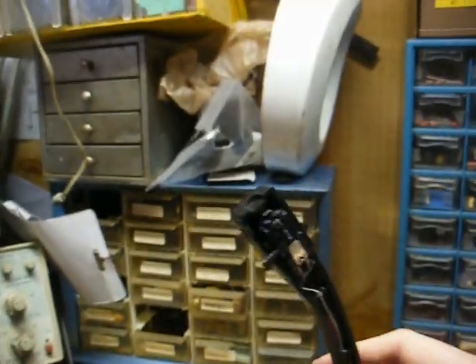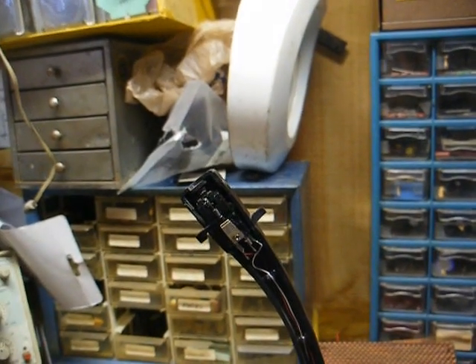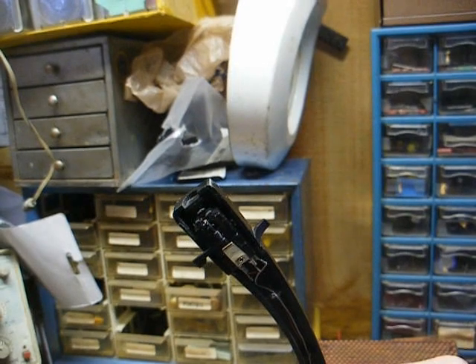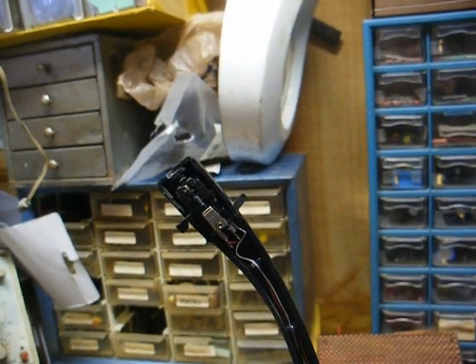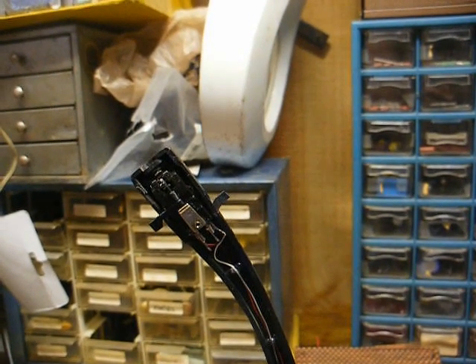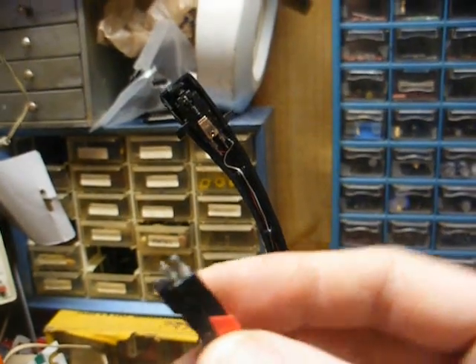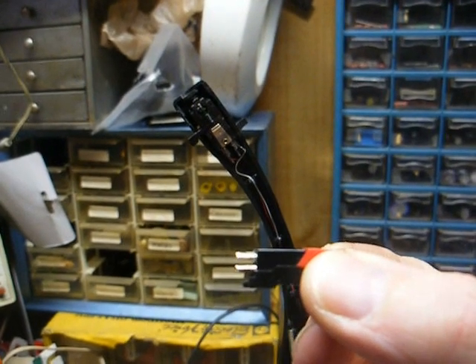Just a word about these P226 cartridges — I've been using them for years. I was buying them back in the 90s from the local parts house for $5.50 each. Unfortunately, they're not $5.50 each anymore — they're more like 20 bucks — but you do what you've got to do if you want to fix these old record players. I get most of my cartridges from eBay or mainly from the Voice of Music website. The P226 cartridges I've ordered in recent years seem to have about the same output as these Crosley cartridges — the Crosley cartridge is rated for 0.3 volts, the P226 is rated for a half a volt.